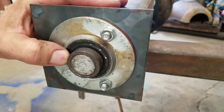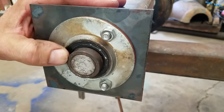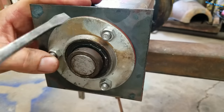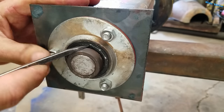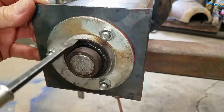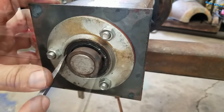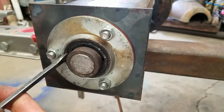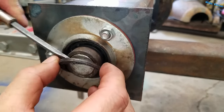How are we going to do that? Well, the easiest way is to take the bearing apart. The first thing you want to do is get rid of the seal. A lot of times you can pop them out with a screwdriver — sometimes not. Maybe you need a little better hook to get into the smaller ones. On bigger bearings it's no problem to use a screwdriver. So you get that seal out of there.